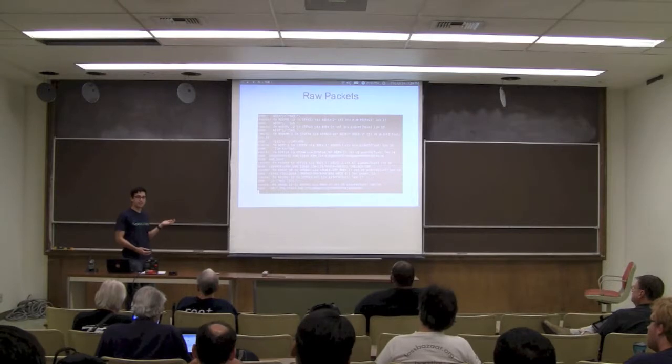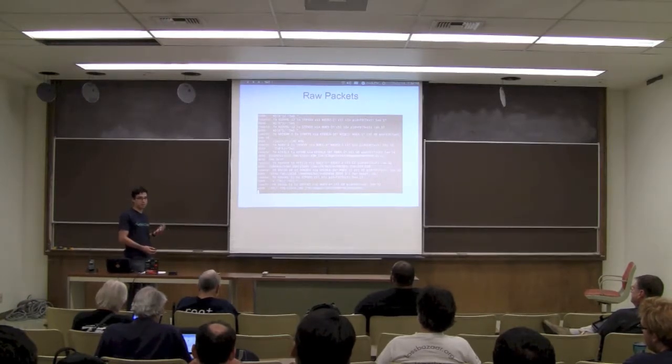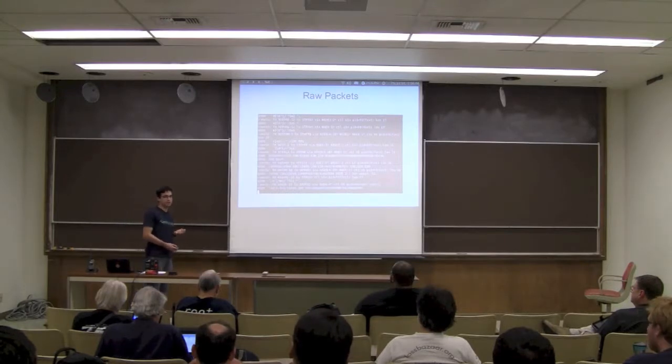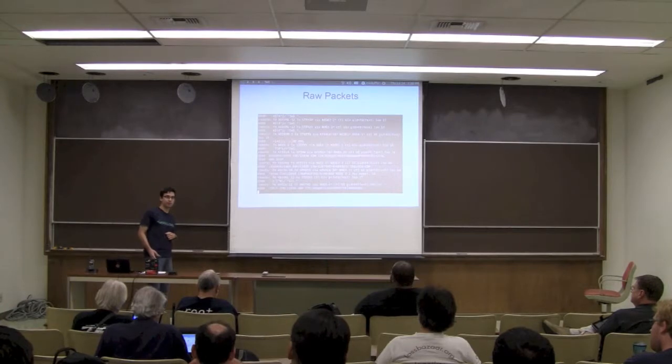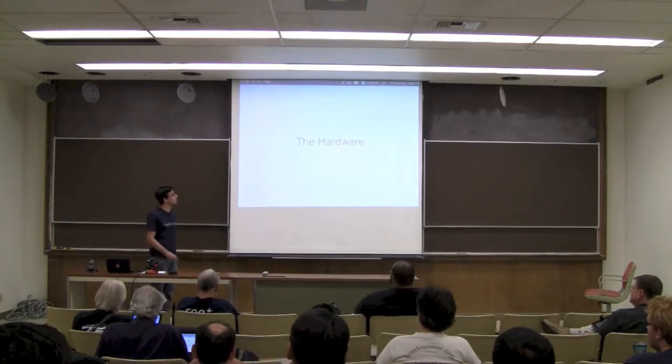A Zigbee can do faster than that. But part of that is because the 2 meter band, where a lot of this activity is going on for APRS, doesn't have a lot of bandwidth for people to tie up. Amateur radio stuff could get a lot faster if you move to higher frequencies, which have more bandwidth. With microwave, you could probably set up links faster than some internet links.